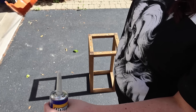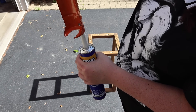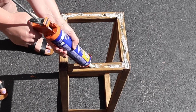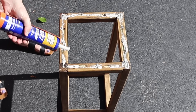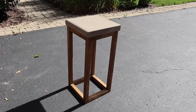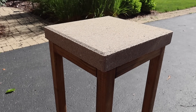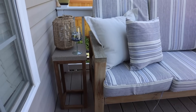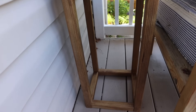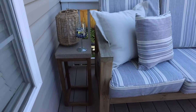If you've never used a caulking gun before, it can be a little intimidating, but I learned last summer. You can cut the tip off with that little handle there and then pop the little pin out to create an opening if you're having issues. Then I ran the Liquid Nails all the way around the top because we're not going to screw into the concrete. It was heavy enough to not need clamps, but you can use them if you want. Let it sit for about an hour, then it was time to install it right next to my DIY sofa that I built last year. It is a great height and could work in a modern organic style interior too.